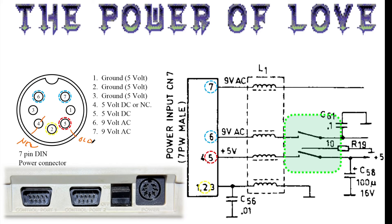This is something that is really under-communicated. It may differ on American power supplies, but on European white power bricks, every one I have — except a really old one with a grayish dark-gray cable — is connected to pin 4. Otherwise all of them are connected to pin 4, the AC is always on pin 6 and 7. The contacts have really small surfaces — just small forks — where contact is made.